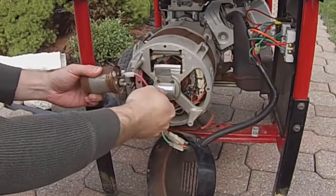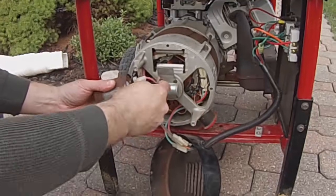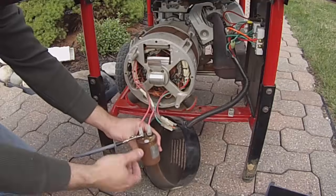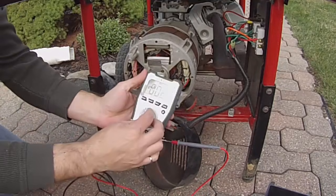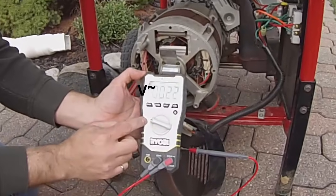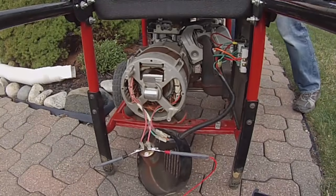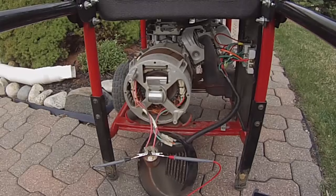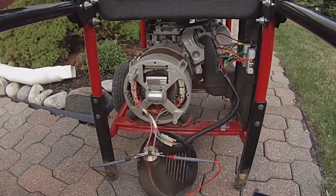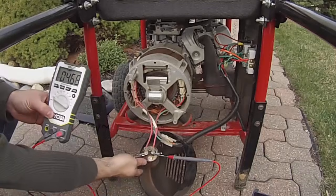The test here is simple. You can take it off to test the voltage between the wires and you should expect to see about 5 volts. I'm going to leave it on because it's easier for my alligator clips. I set my multimeter to voltage AC — that's the V with a little sine curve squiggle over it — and then we start it up. The rotor in the alternator is turning, which is a good sign. The multimeter shows just under 5 volts — close enough. It means the alternator is working perfectly, and it's the capacitor that needs to be replaced.